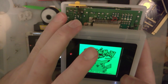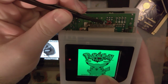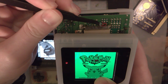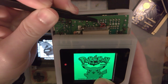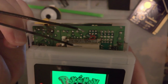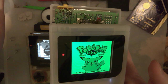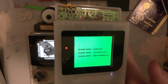It looks like that's all we need to do: cut the trace for these two data pins. From the right, this is one, two, three, four, five, six, and seventh pin — these are data zero and data one. I don't know which is which. Cut the traces for the two and then swap them. I'll take a pic so you can see my wiring and post a link in the description. Hey, that's cheap and easy. It's not perfect, but it's a lot better. Thanks for watching, guys. Have a good night.